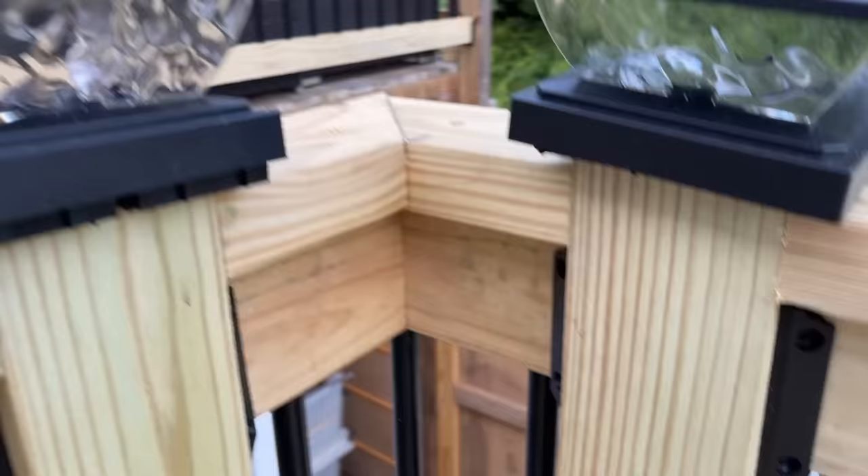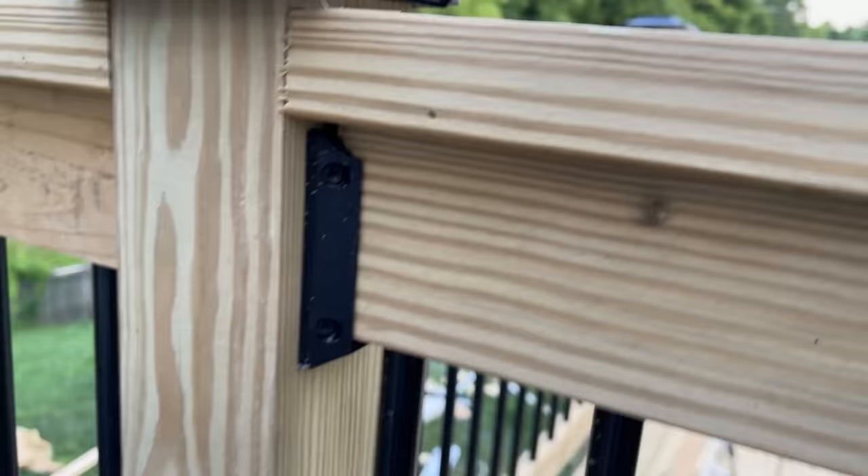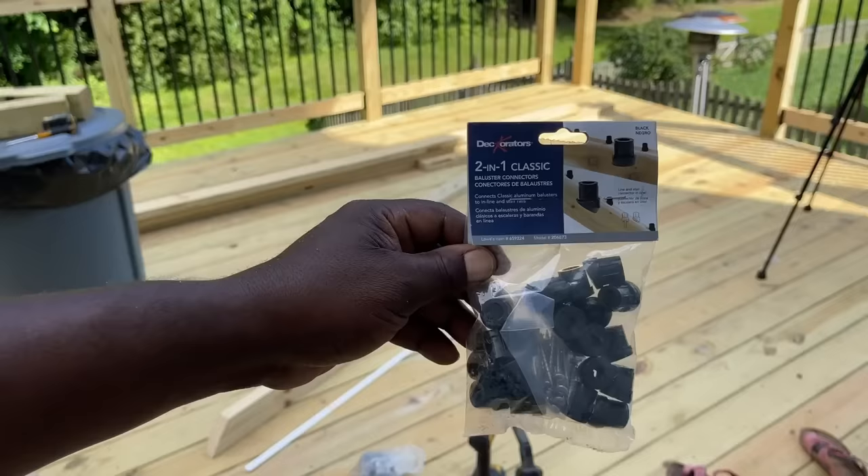This is the detail of the corner. I just used a cleat there and there, brought the wood over to a 90-degree angle, same thing down below, and measured over four inches from here to here and four inches on the other side. That's how it looks.